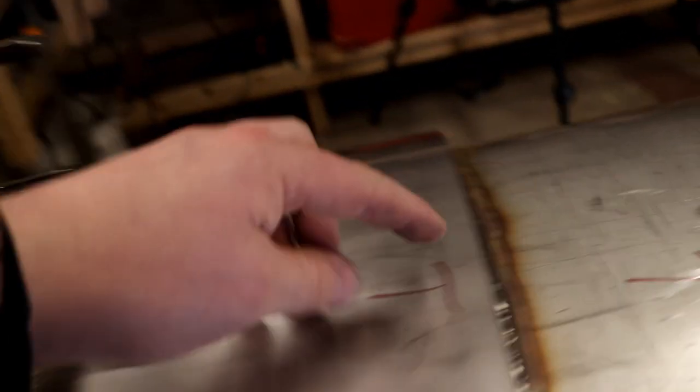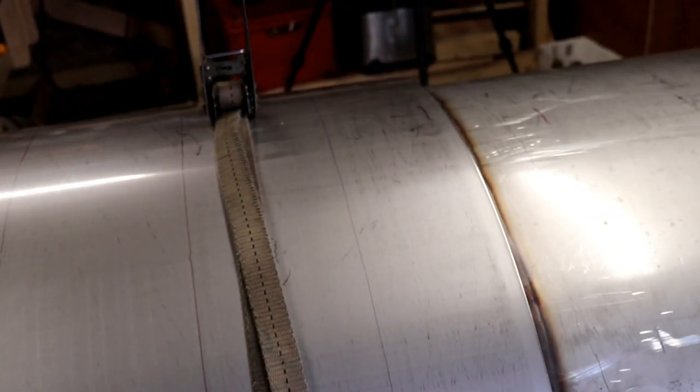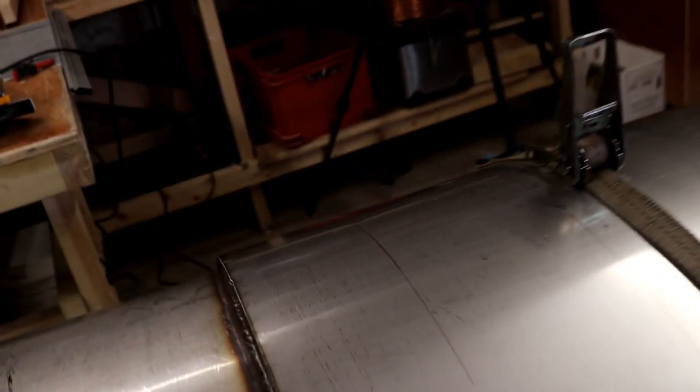And to prevent getting any buckling, I'm going to start tacking from the centre out on both sides, sort of this way, same on here. Hopefully that's a more sensible approach. So I'll just lift this off and we'll blow a few holes into this piece of sheet.